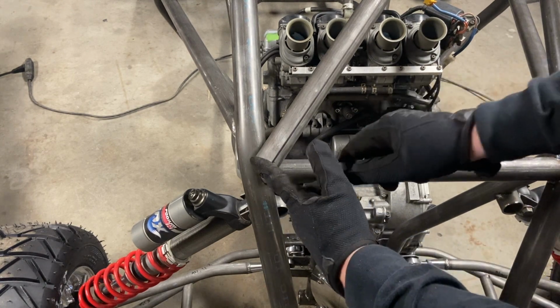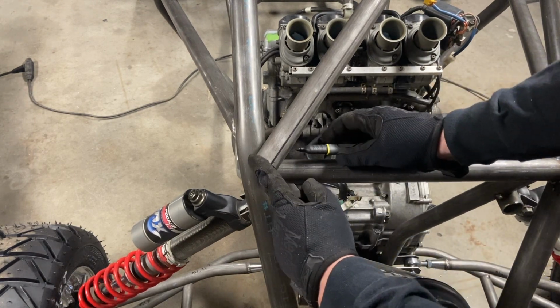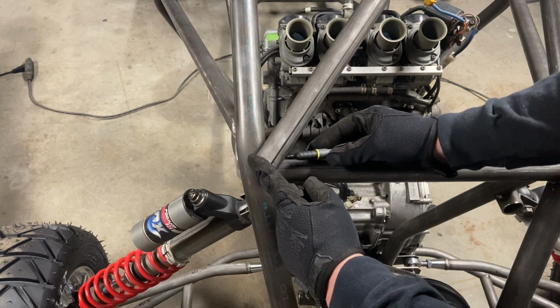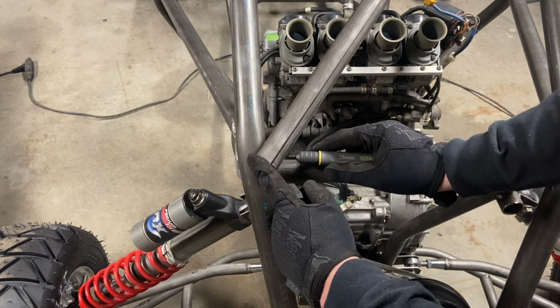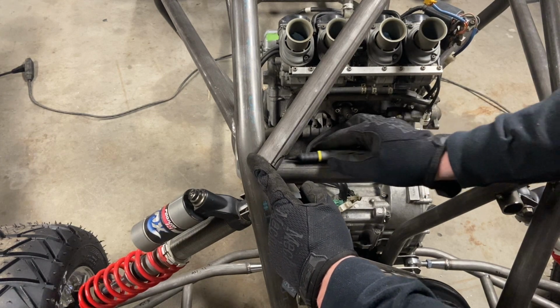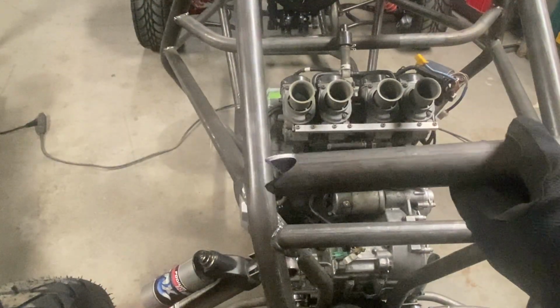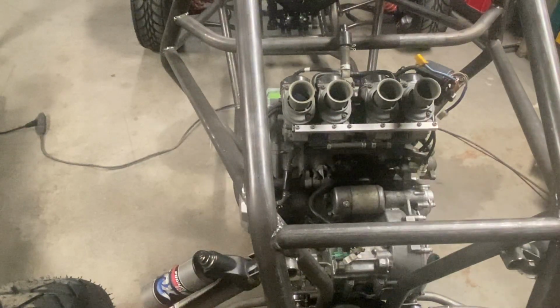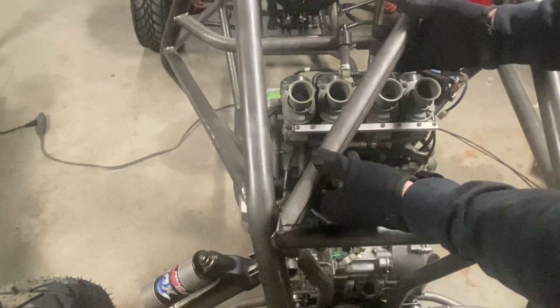Now you're going to measure your inside length. So that's the length where the deepest part of your cut, or the deepest part of your fish mouth, is going to touch this bar. Now, all right, there we go. We've got a double fish mouth there, and we've got a double fish mouth on this end. Now it fits in there, but we've got an issue.